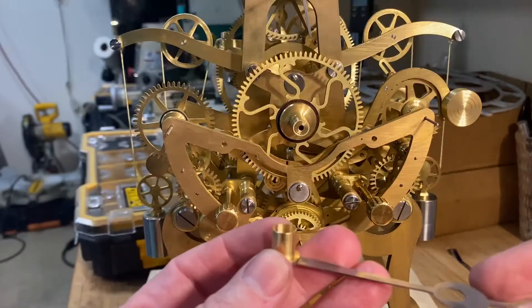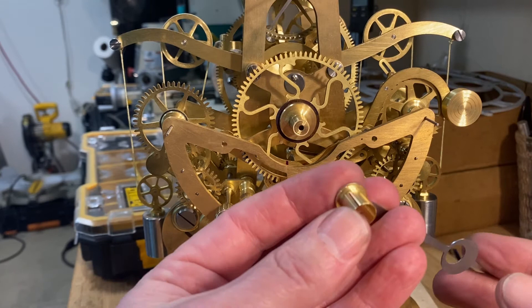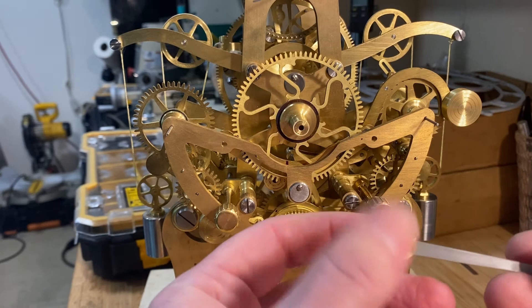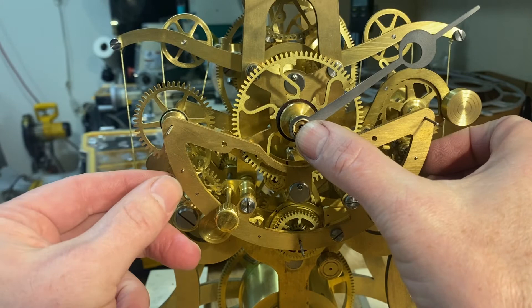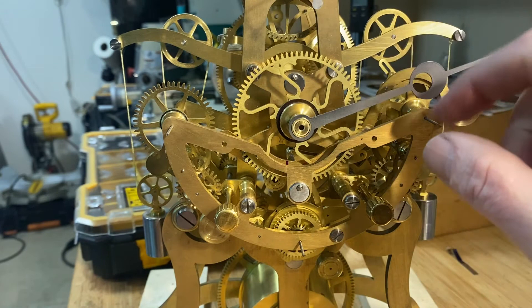If you look at the piece, I've got the hour hand mounted. This still needs to be polished and blued, but you can see the part. Tough to see the slit we put in here, but it's got a taper and you can see it'll go on this part — it pushes right on here and it's a perfect fit. I'm pleased with how it came out; I think it'll end up very nice. A fun part to make — hope you enjoyed it. If you do, please subscribe and leave me any comments. Thanks and we'll see you soon.